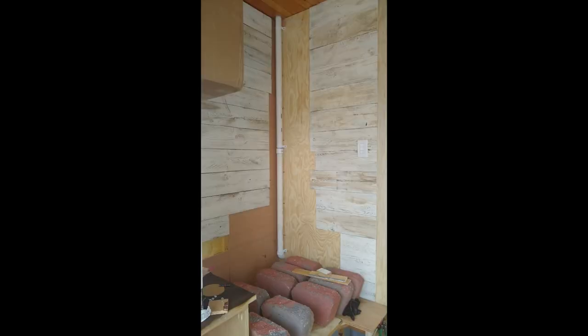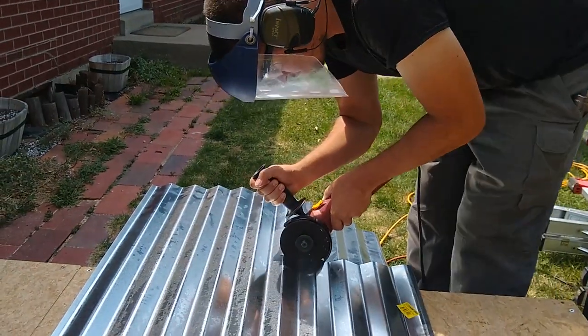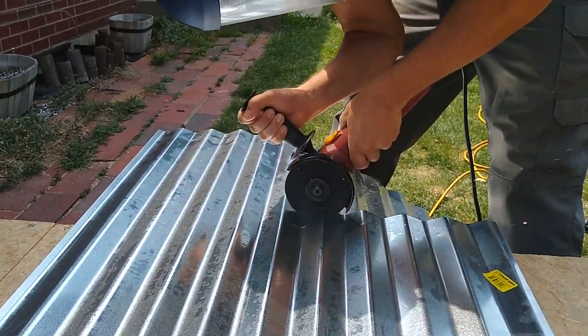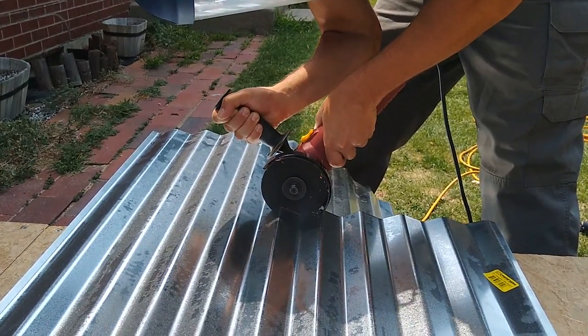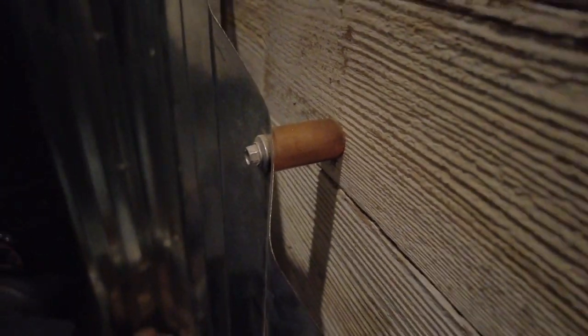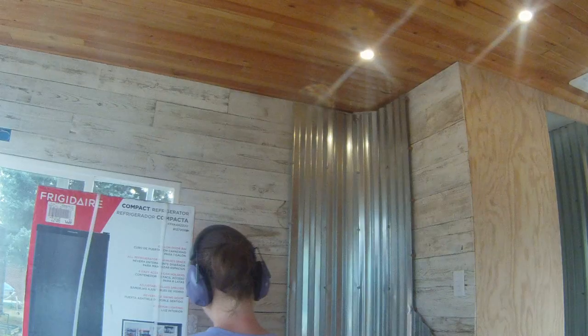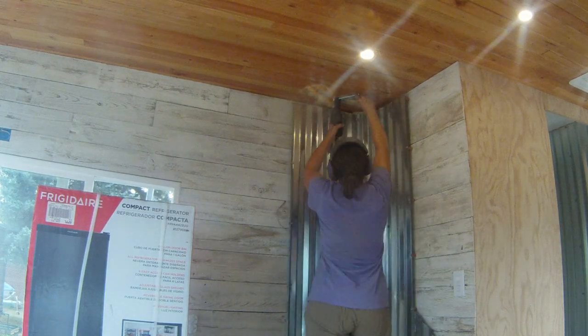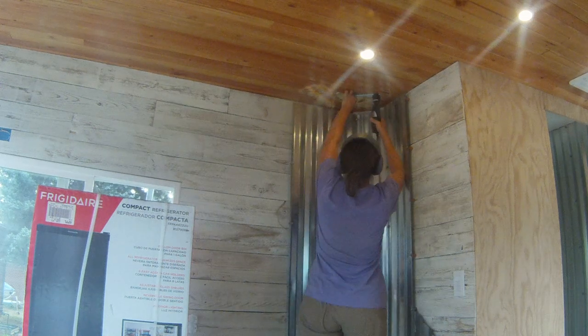The corner behind the metal heat shield was the perfect place to hide our bathroom exhaust. We cut and hung metal sheets behind the stove. To ensure the corrugated metal sheets would act as a proper heat shield, we needed to create an air gap between the wall and the metal. We used half-inch diameter copper pipe to offset them from the wall by one inch. We used a Dremel tool to cut a 10-inch hole in the ceiling for the double wall portion of our flue.